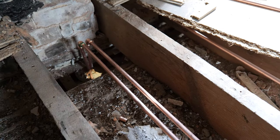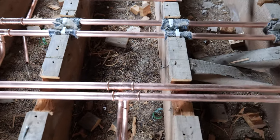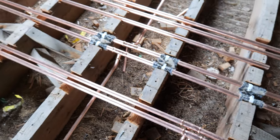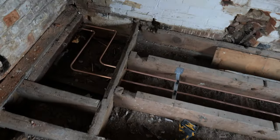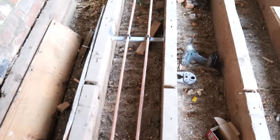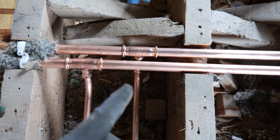We're back upstairs on the first floor, just picking up those rads we're installing in the kitchen. Using the wall ravens again to make it nice and neat — all we're doing is teeing in on to the downstairs flow and return. We've got the downstairs flow and return here and the upstairs flow and return there. Once we finish putting all our tees in, we'll get it all felt and lagged. The feeds here are for the rad in the kitchen on the right-hand side — brought along the wall ravens, teed in, and that's all good to go.